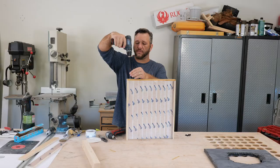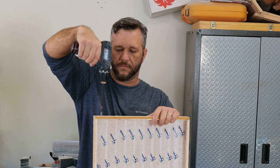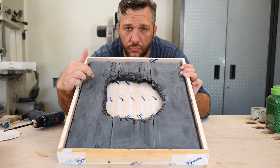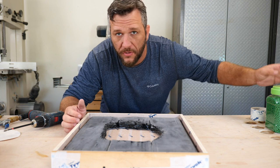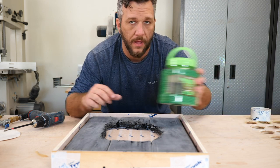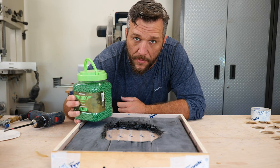In the past when I've done this, I just stapled these together, but I thought I'd go full-on professional this time. I've got my tabletop in my form and ran two screws at each corner from underneath to hold it in place. To determine how much epoxy I need, I'm going to use a trick from the fire epoxy guitar and use airsoft pellets to fill in the space, then put them in my bucket — that'll tell me how much epoxy I need.